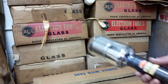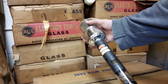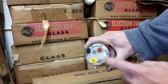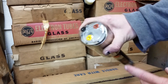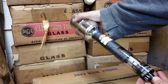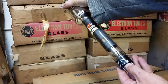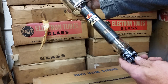Here's one that Raytheon made — a QK464A. Very similar. This one's a magnetic deflection type. They used three pins on the front here and gave them nice color-coded blobs for some reason — I don't know why. Like I said, these were used in radar. It's got 6835 as the standard number, and QK464 is the Raytheon number — QK sort of means special tube.